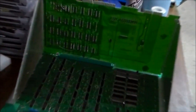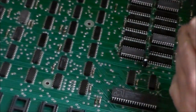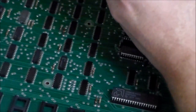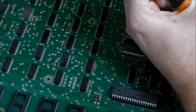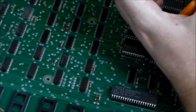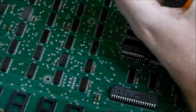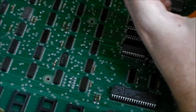I'll show you the best way to change out a RAM chip — or any chip really. We know that chip's bad. So instead of trying to pry it out of the board where we could potentially screw up the board, I'm going to cut it out with these side cutters. What I'm doing is cutting the legs off of the chip, which will destroy the chip — but we think the chip's bad anyway. You're better off destroying the chip than destroying the actual board.